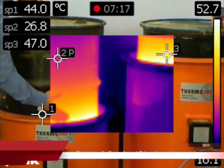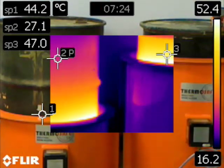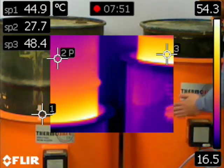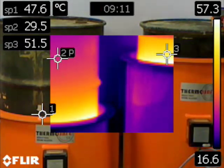Note that the temperature of the drum wall within the magnetic field will always be higher than the exposed drum. The temperature on the outer surfaces of the ThermoSafe heater will always be considerably lower than the drum wall itself. The working heat is being generated by the steel drum itself and not the ThermoSafe unit. The outer surfaces are only getting warm as heat is radiated from the drum through the induction coil. This dramatically increases the thermal efficiency and speed of heating.